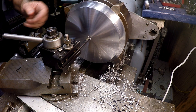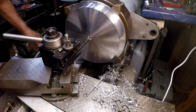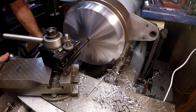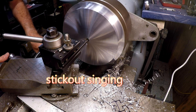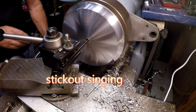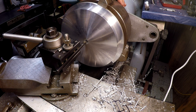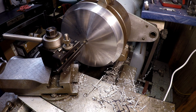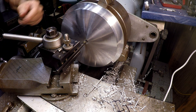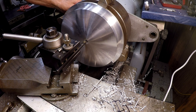Got my tool touched off on the face of the plate — we're going three quarters of an inch deep and we'll get into that three-eighths hole first. I've reset my depth, shortened up the boring bar, and I've got a dial indicator over here to check my depth, back on where I was. We'll take a pass and see if we get a nice clean cut.